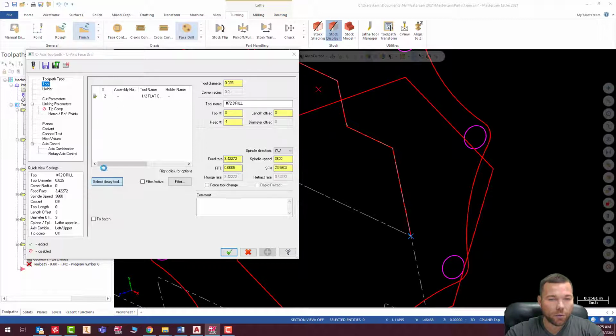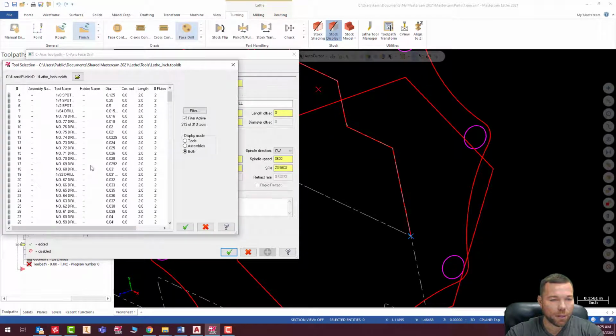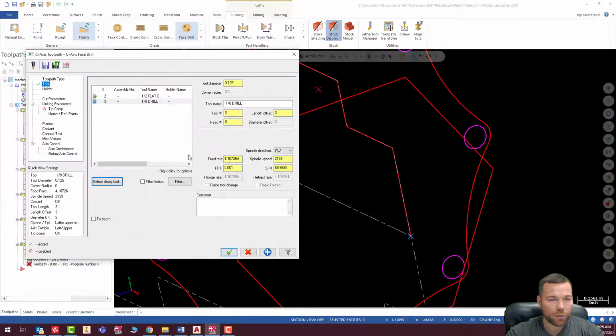And I'm going to go into my tool library. This is an 1/8-inch drill. Somewhere here should have an 1/8-inch. That's 1/4. There it is. 1/8-inch drill. Feed rate, let's take this at 8.0. Spindle speed's fine. Feed per tooth's good. Okay, so